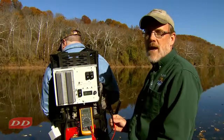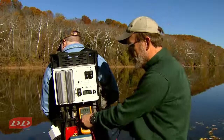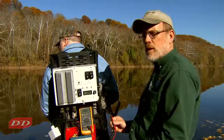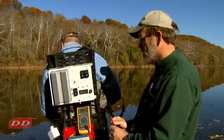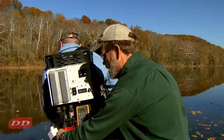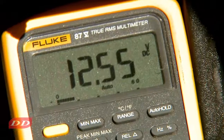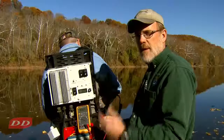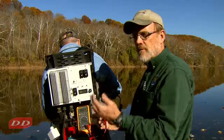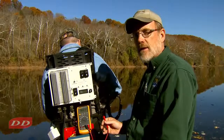If your unit does not have a battery output meter, you'll need to use a multimeter set to DC volts. Put a load on the unit and check across the battery terminals. We have about 12.5 volts - plenty of battery capacity. These units shut off when battery voltage declines to about 10.5 volts; we're well above that. So it's not the battery, it's something else.